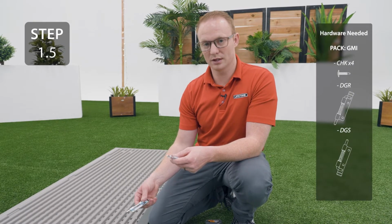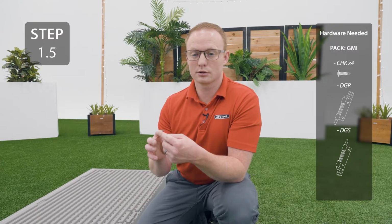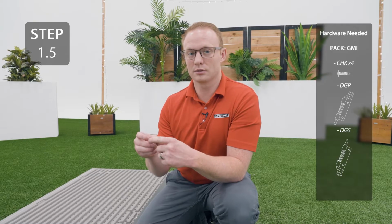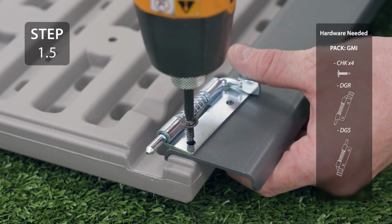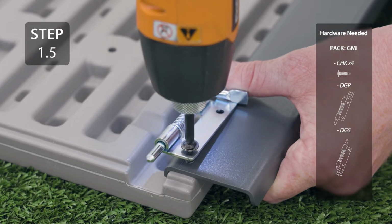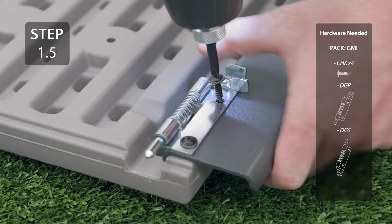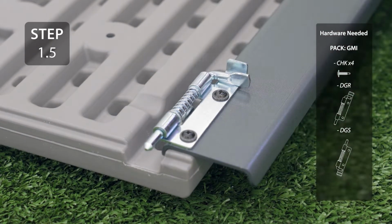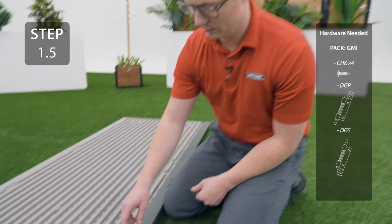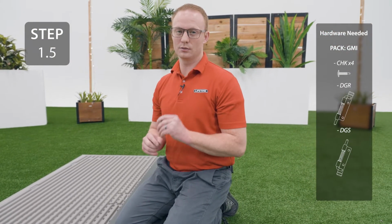There are two dead bolts and they are different. Place them over the holes on the door and channel, making sure they're oriented like this. Secure with the screws. The screws may look too big, but they are self-tapping screws, so they are designed to create a tight fit. Verify that the lock can move freely. If it can't, go ahead and loosen the screws just a little bit.